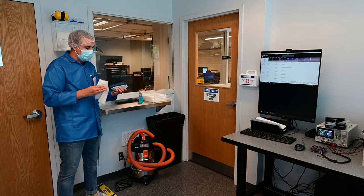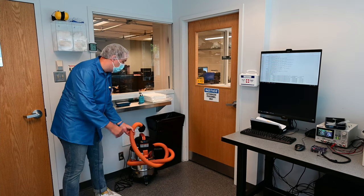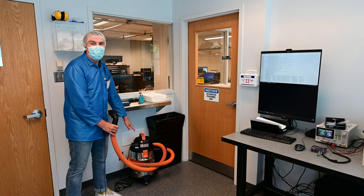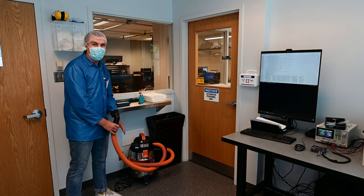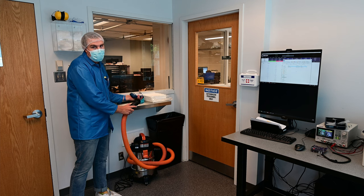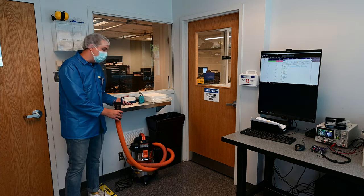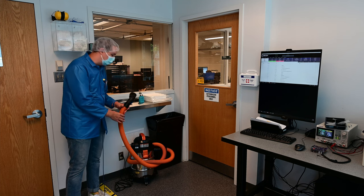The wipe is now saturated and you can go ahead and wipe off any dust or debris on the object. Generally speaking, the easiest way is to use the shop vacuum, which has a HEPA filter and a dust bag inside, and just vacuum off the dust from your object. Those are the two different ways of cleaning things before bringing them into the clean room.